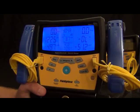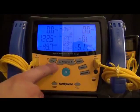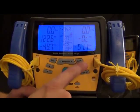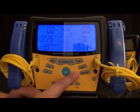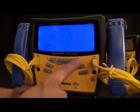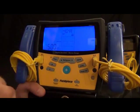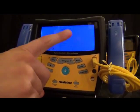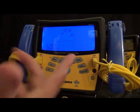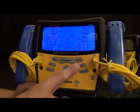You can set the alarm on it — a low alarm and a high alarm. When the unit starts pulling a vacuum, it will automatically go into vacuum mode and display the microns. There's also a Units button: if you want to change units, just press it and select what units you want. You can customize it to whatever units you want.